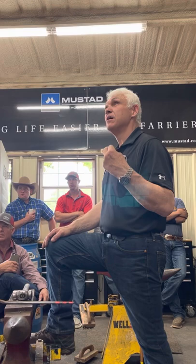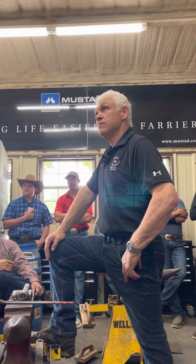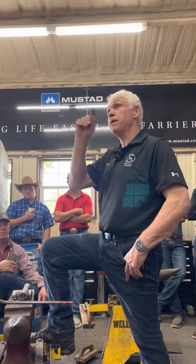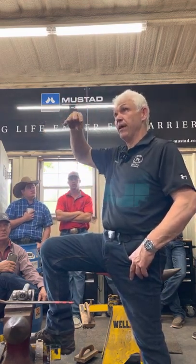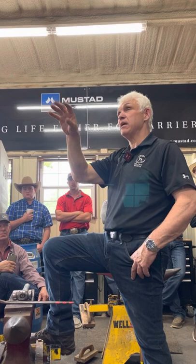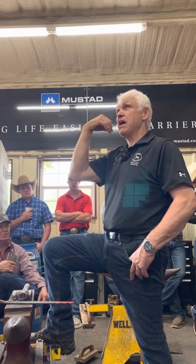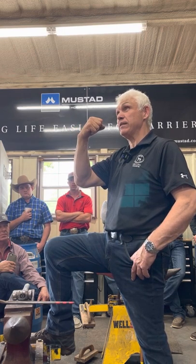For some of us that are just now building shoes, do you have any advice for that final stamp to the anvil, not wrecking your tools? Listening and feeling. And you will screw a few up. But me describing what you watched other people have experienced doing. You think they're hitting it hard, so you think you have to hit it hard. I've described what I'm feeling. I'm stamping to the anvil. But most people then interpret that as he's hitting it hard, and you drive your punch into the anvil, and next thing you know, you've got a wadded up punch.